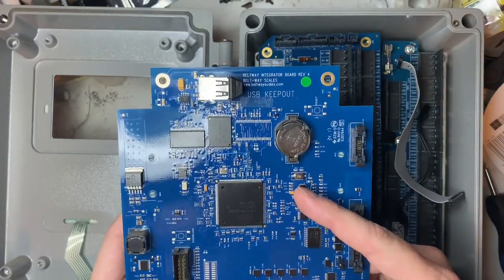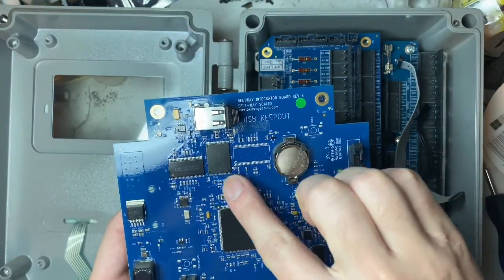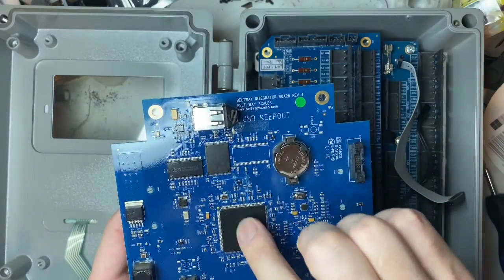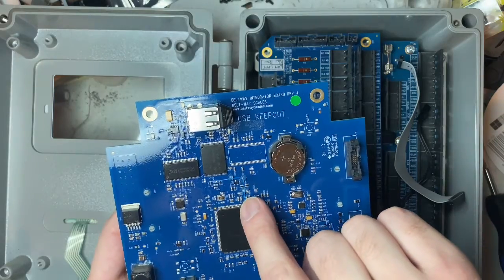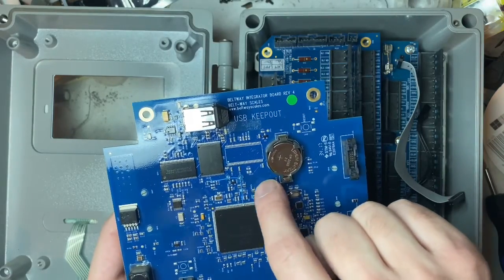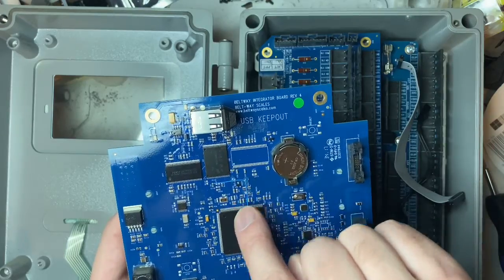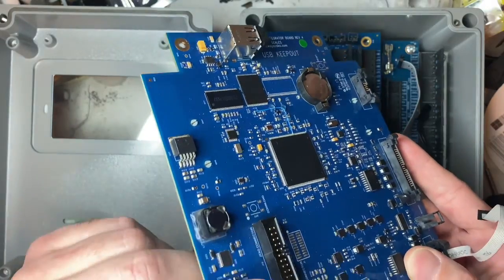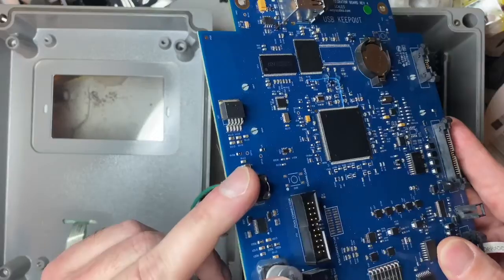You'll wonder what this might be — they call it a wire mod, and it's done by a board vendor. I actually had a different wire mod that blended into the board itself — you couldn't tell, and it didn't have hot glue on it. This coil and capacitor here: make sure you glue those down too, as they break off as well.